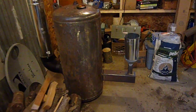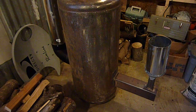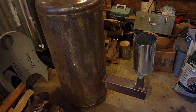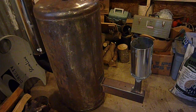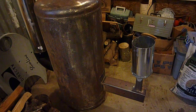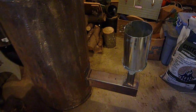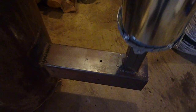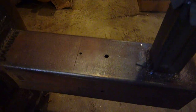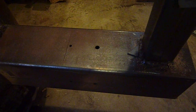This is the stove — it's an old hot water heater tank. It will run up to nearly 600 degrees. I found that the plates the pellets burn on are really the thing that regulates the stove once you have enough air going into it. I've drilled three five-sixteenths holes in the square tubing here — they let air in right into the drilled holes in the burn tube.